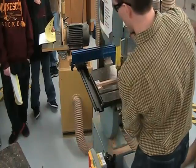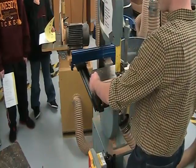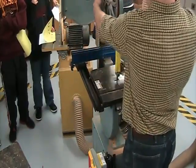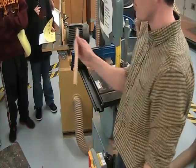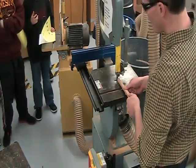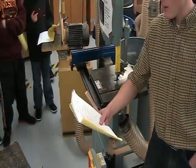I'm asking you not to pull straight backwards. Listen to that wheeling sound — that's the two sides of the board pinching the blade. These two sides are actually grabbing onto the blade, and when you go backwards you're probably going to pull it right off the wheel, which means it'll jam and usually snap the blade — that's about a $30 blade. Do not back up on deep cuts. Should you stop the band saw by forcing a piece of wood against the blade? No — that's hard on the equipment. Anytime you see the word 'force' on any of my quizzes, it's always a giveaway that it's not safe.